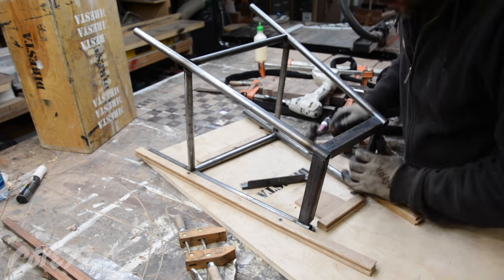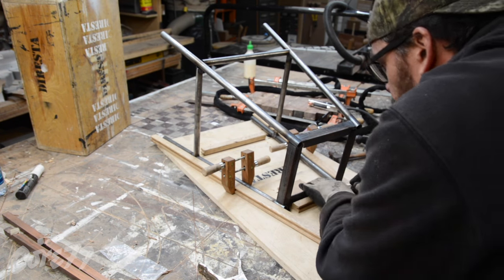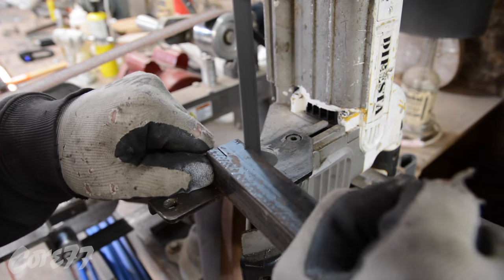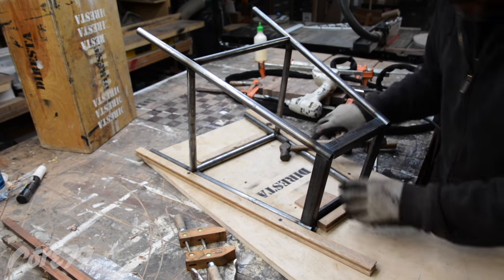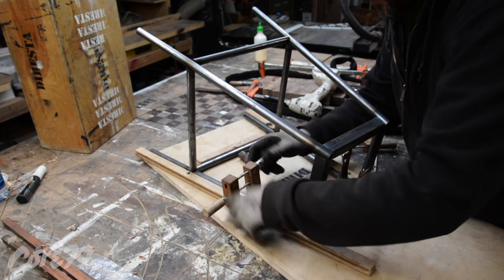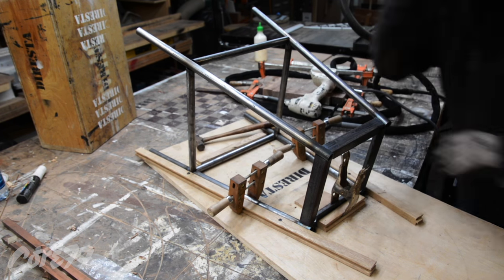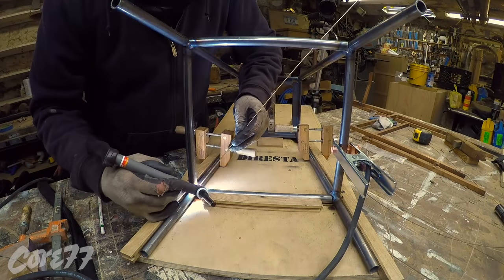And there's my last piece — my foot rung, you might call it. And then my last piece of angle iron, which also needs to be notched. And there I am notching it again — notice how I used that piece of scrap steel to prop it up while I cut. Now we're ready to weld the fourth side in, and right now everything is tacked. Once it's all tacked and everything sits square, and I'm confident everything is in order, I will then weld everything all the way home.